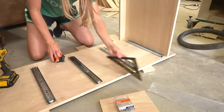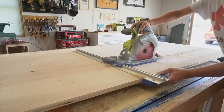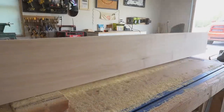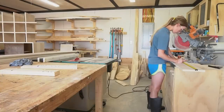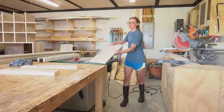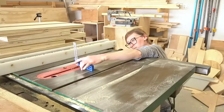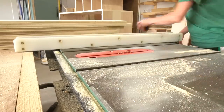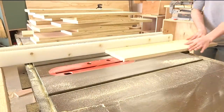After the slides were in, it was time to build the drawers. I dug out another sheet of plywood and began ripping strips down to cut the drawer box pieces from. I trimmed the strips to length and began cutting dados along the drawer box pieces to install the quarter-inch plywood bottom panel. You can use a dado blade for this, but I prefer to set my blade height to a quarter-inch, adjust my rip fence to cut the dado about a half inch from the bottom edge, make a pass, then adjust the fence closer and make one to two more passes until the dado is about a quarter of an inch wide.